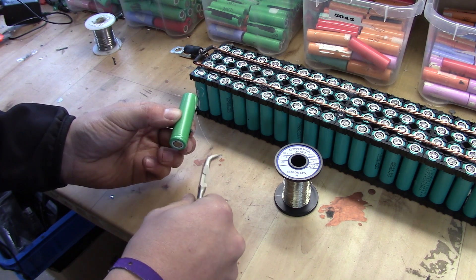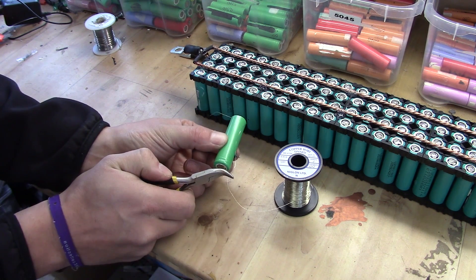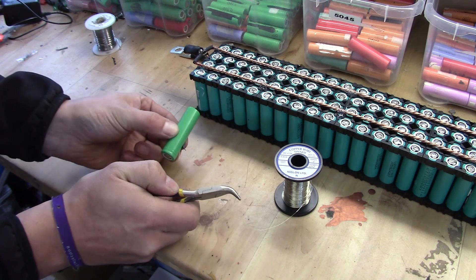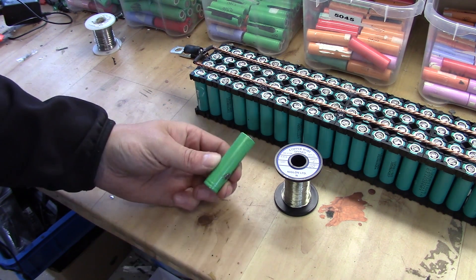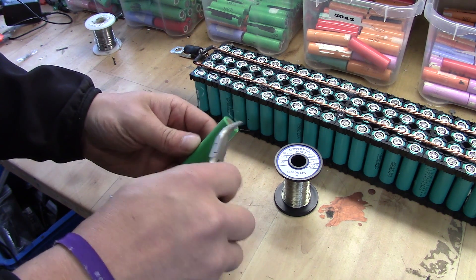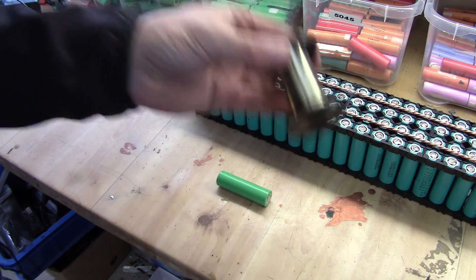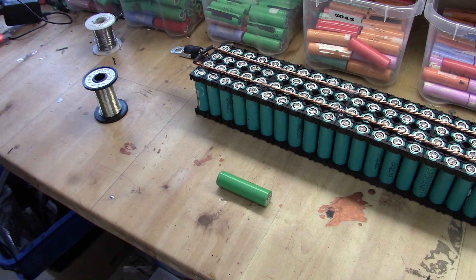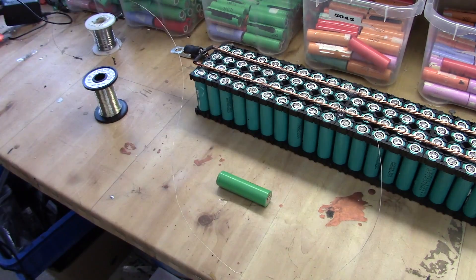I do recommend that you test the fuse wire out first. As you can see, even though I use that whole length of fuse wire it did melt — and that's the goal of this fuse wire. If you have a dead short it should melt. At the same time, if we take this shorter or thicker one here, that may not break, but that's kind of okay anyway.